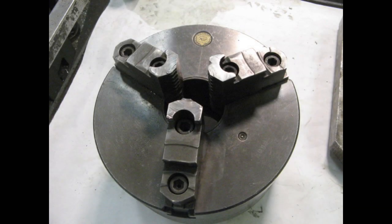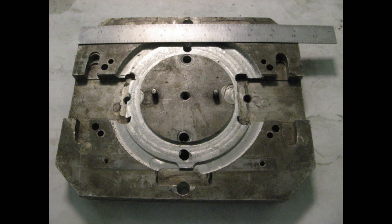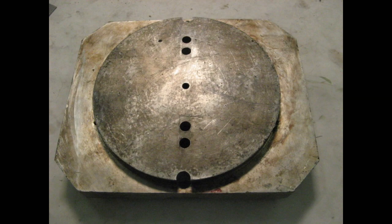But I'm finding that almost everything I do on this rotary table would work better with a three-jaw scroll chuck. It would be just that much quicker to indicate items in the rotary table, and it would be more convenient. So I've got this older Bison 8-inch three-jaw scroll chuck. I replaced it with a set-true version of the same thing, another Bison 8-inch, so this one is available. And I also have this ugly old piece of tooling plate that came out of a CNC machine shop. I think I can make an adapter to quickly and conveniently mount this 8-inch chuck onto the Palmgren rotary table, and it'll be a much handier tool for me.